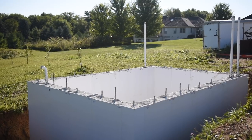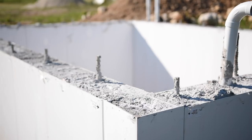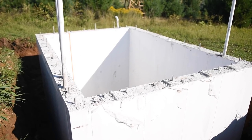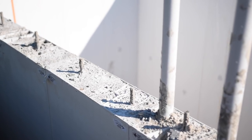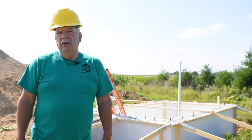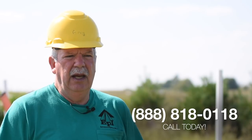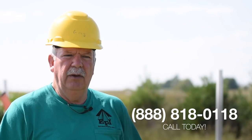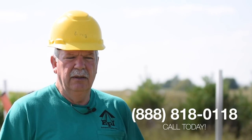We have finished pouring the 11 yards of cement into the Extra Tech concrete wall forms. After letting it dry for a day, we have removed the bracing. You can see that the forms are nice and straight with no pivoting. The walls are now completely finished and waterproof. The next step is to pour the basement floor and add the top deck. Thank you for watching this video. I hope you have learned more about the Extra Tech stay-in-place concrete wall forms. Please call us at 888-818-0118 to discuss your building project and talk to our friendly staff. We look forward to hearing from you soon. Thank you.